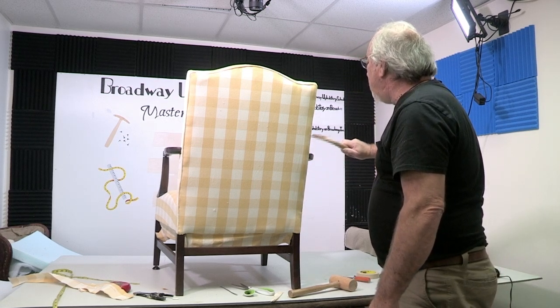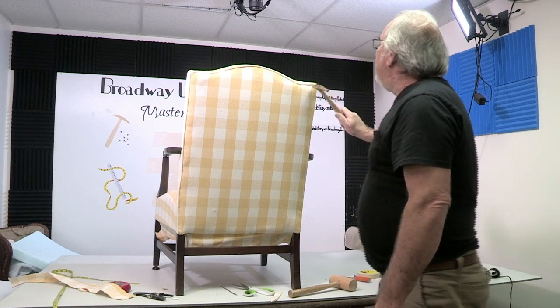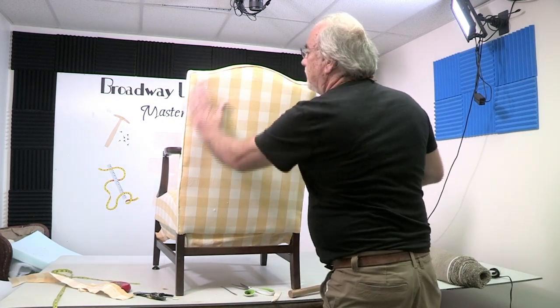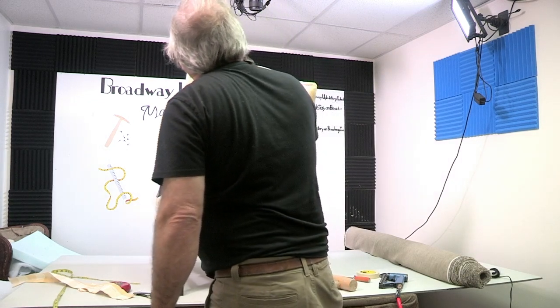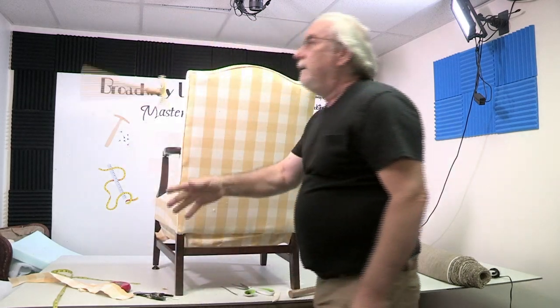This little subtle pull down like that, and then hold it, push it in, hold it. I'm using my regulator — some of the things I do are so mechanical I don't even think about teaching them. What I'm doing is going like this and then taking my thumb and just doing a little pressure to make sure that the end of it falls in so it doesn't peak out. Look at how beautiful — I love ply grip. Then we're going to take a stretch here, another cut here, put a little pin in here. The last thing you do is take your hammer and go along very carefully — your magnetic hammer does a little bit of a better job of closing the ply grip. Be careful with a lightweight fabric, and also you want to check to make sure there's no staples. See you next time.